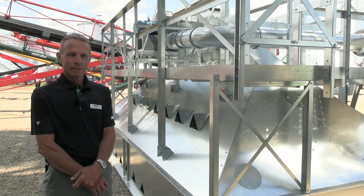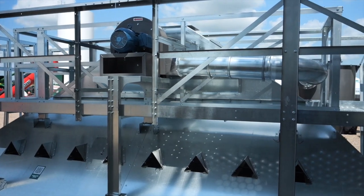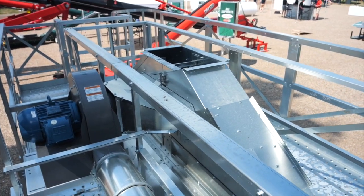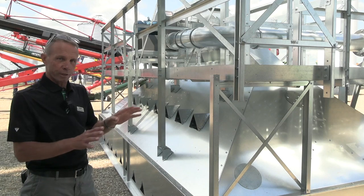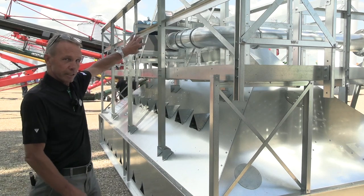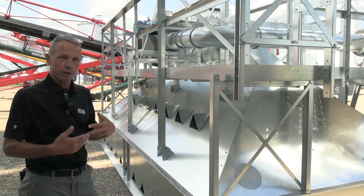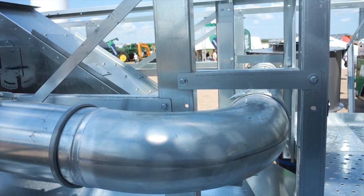Let's talk about the product here. Let's look up at the top of this machine — I see something new that I haven't seen before. What is it? Well, right now what we're looking at is the roof of a 16-foot dryer. We have one on display here at AIM specifically to show off our new pre-cleaner. The upper portion of the gravity fill gets changed out. We have a series of plates in there that distribute the grain a little bit, open it up and allow air to flow through it. We've got screens on the far side of this gravity fill section and it gets drawn through by a fan and transition on this side of it. That sucks the fines and the chaff out of the grain as it's falling into the dryer, and we blow it off to a cyclone where we can collect all that material and dispose of it — or feed it to the cattle if we want.